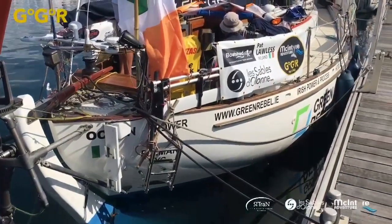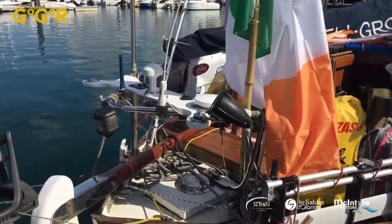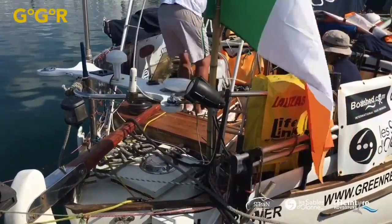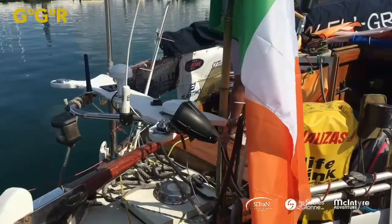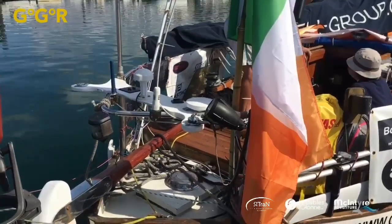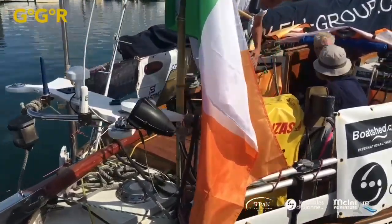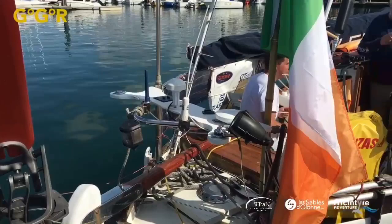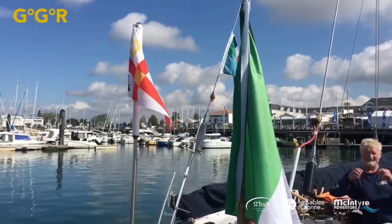Pat's made up a platform here. He's a carpenter and woodworker, so you see lots of wood on the boat. He's got his Walker towing log there on the starboard side. Behind that, the little white hockey puck is the YB-3i satellite tracking unit. He's got a VHF there — the little blue one on the side will be his transponder, or maybe the C-Tel alarm. He's also got two HF antennas — one for the receiver and one for the transmitter — with the coax cable standing off from the lower part of the main rigging so you don't lose any power. The Globe Yacht Club burgee is flying from his Echomax radar transponder.